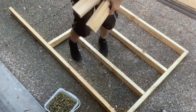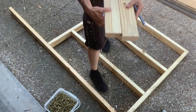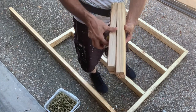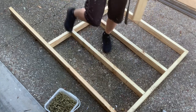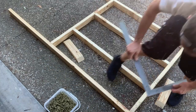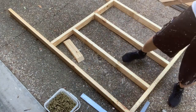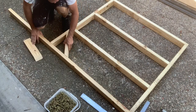So it's 18 inches — I wanted to go all the way from the corner to here. I happen to have these two 15-inch-long scrap pieces. I'm just going to cut 45-degree ends and use those for corner blocking. It doesn't need to go all the way in to provide strength. So I'll just save a little wood and use the scraps I have. Looks good — close enough for some chickens. Hopefully they don't complain and give us less eggs.